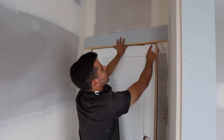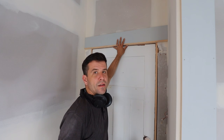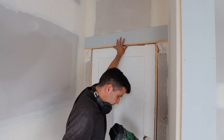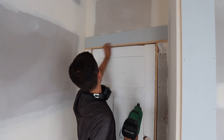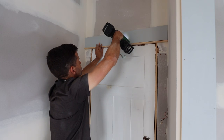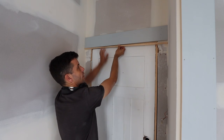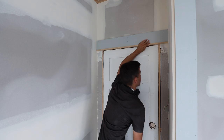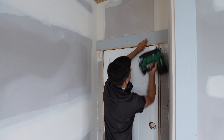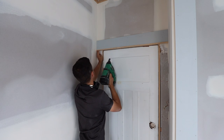I'm happy with the height there. I've got a quirk — it's about two to three mil from the edge of the door jamb. Now I've got to turn on the Hikoki nail gun because it turns itself off all the time. Then the other side — even Stevens. Then I get the 18 gauge and that goes under, like so. Make sure it's hard into the door jamb. The 18 gauge is great for this because we've got thin nails. Make sure it's hard into the door jamb. That's how we do the head — get that 10 mil look.